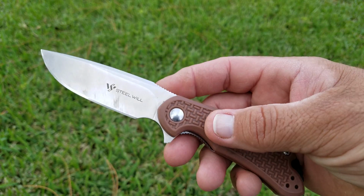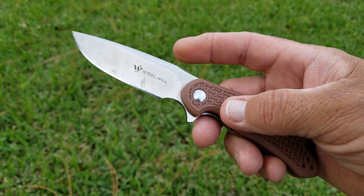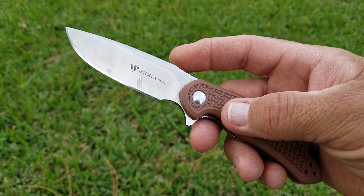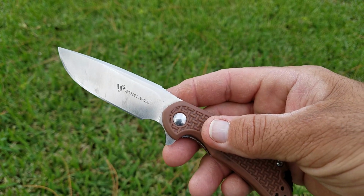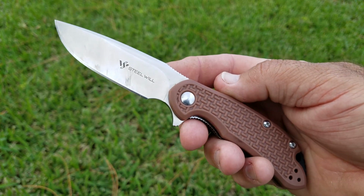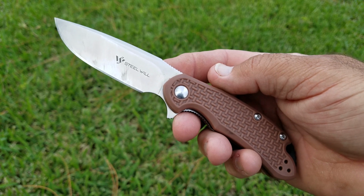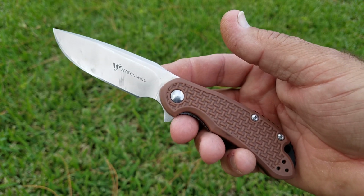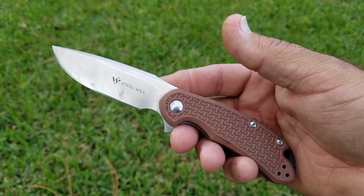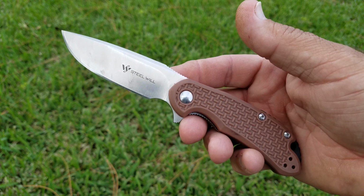How did I get that out of D2 that isn't so great? The first 4 days I was able to strop it back to perfectly usable condition using only 6 micron DMT diapaste. Starting on day 5, I switched to the 16 micron Bark River CBN on cow leather, followed by the 6 micron DMT diapaste on horse leather.